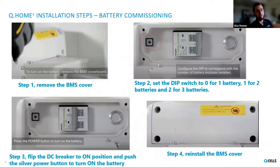On the battery unit there's a breaker, a button, and a dip switch. The breaker has to be on and the button has to be pressed for the system to power on — we always reiterate to folks to check that. The last item is the DIP switch, which goes from zero to seven and needs to be set according to the number of batteries in your system: one battery is set to zero, two batteries is set to one, three batteries is set to two. If the dip switch is not set, it will throw a BMS error. It's a very easy fix — just hop on the phone with an installer, ask them to check these things, and it turns the system on.